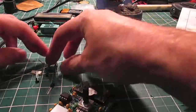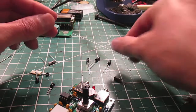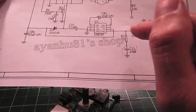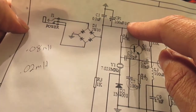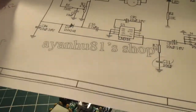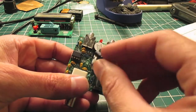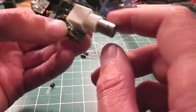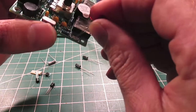It's starting to look like a little radio. We have four electrolytics here — 100 microfarads and some 10-microfarad caps. From the schematic, the 100 microfarad, CP1, goes up at the top for power filtering — that makes sense. The rest of the electrolytics are all 10 microfarads, so we can just drop them in without worrying about location, just pay attention to the polarity, which is clearly marked on the board.